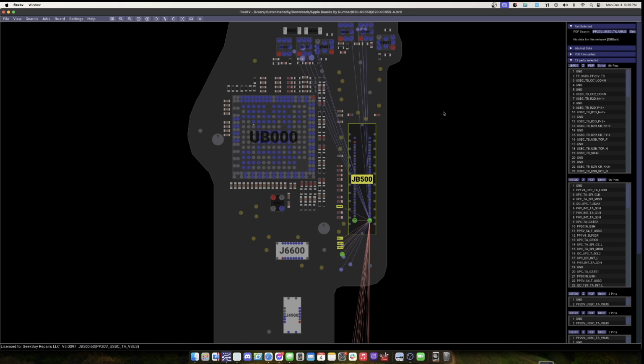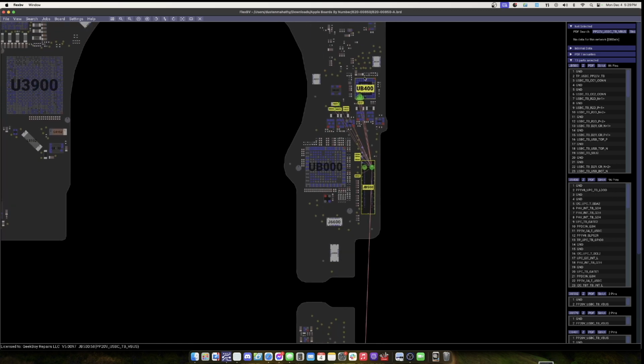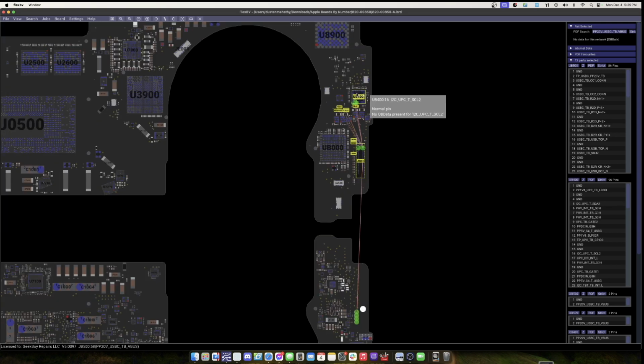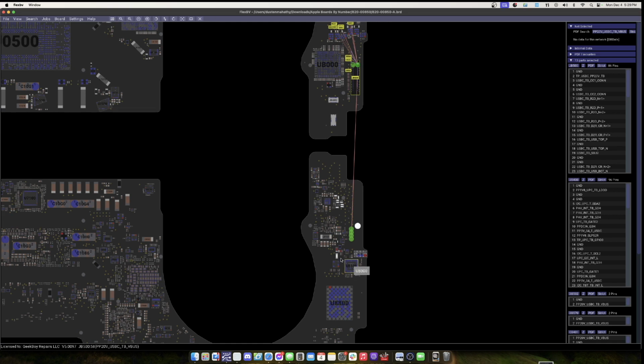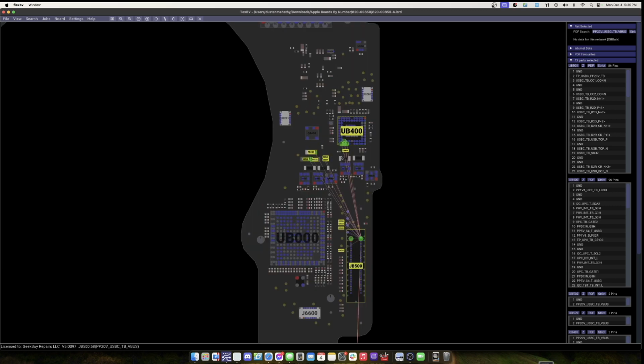So if I'm plugged into this bottom port here, and this is going to be the 20 volt inline I'm looking for, which tells me that it's this CD3215, this top one that I have not touched yet. Remember, this bottom one was the one that was removed, and that area was demolished, and we have already fixed that, or we hope we have fixed that, right? So now we've got to look at this CD3215 and hope that this is our issue. So we're going to do some probing around this one and see what we get with our multimeter.